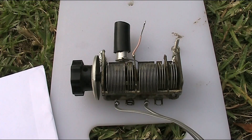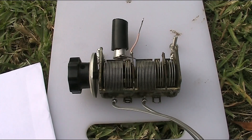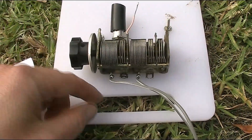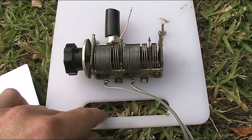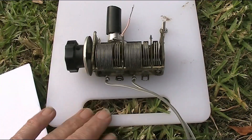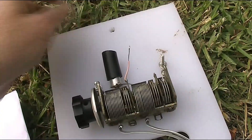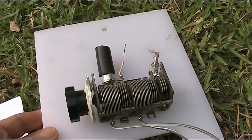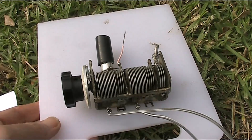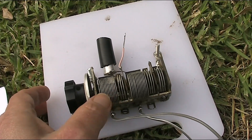Here are the other bits of the antenna. I don't know if you'd be able to get this through security at the airport, so you might want to make it look a bit prettier. This is the capacitor at the top of the loop. I'm using a chopping board, and I'm going to use some Velcro straps just to suspend the inflatable loop from the bottom of this. It's a two-gang variable capacitor, though you don't have to use a two-gang. The benefit of the two-gang is that I've got the gang sections in series — that halves the capacitance, but it means less loss.